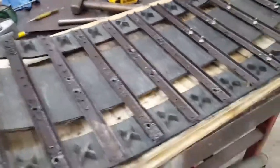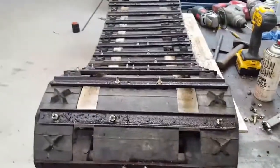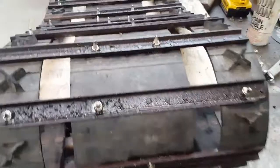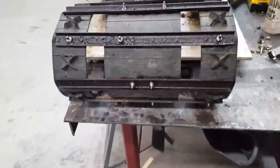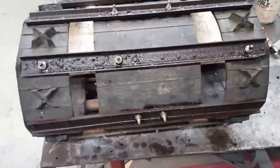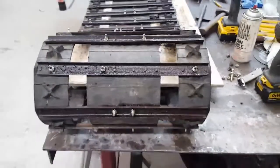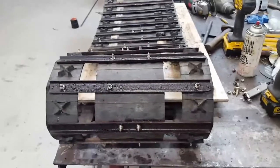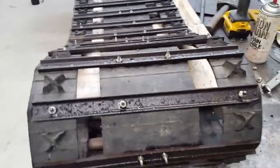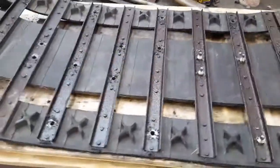I just want to pass this on — hopefully it'll help somebody when they want to stud a cleated track. Looking down you can see my pattern: it's just three on one cleat, two on the next cleat. Could have gone a lot more, but the sled's not going to see a lot of ice time — it's going to be a little bit of trail riding, just for enjoyment. I didn't want to go too nuts on the studs. When I calculated out I have about 87 studs in here. There'll be plenty — it's better than just regular cleats. That's what I wanted to show you guys. Thanks for watching.